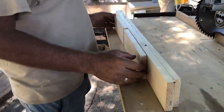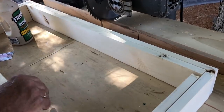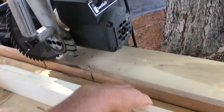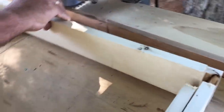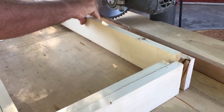Oh. And then you've got a half inch overlap. Right. And when the lid closes down, yep. So good weather seal. So what happens? The inside goes up for the weather seal. Like that. So then the lid's got a rebate in it, so when it closes down, you've got a watertight seal.